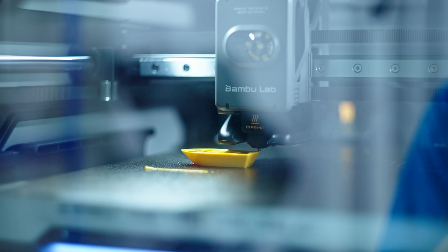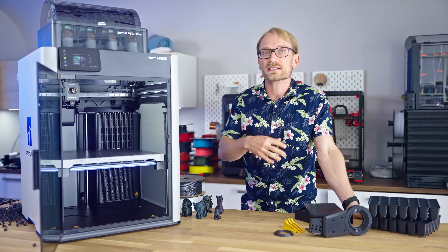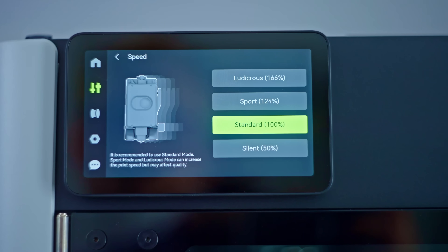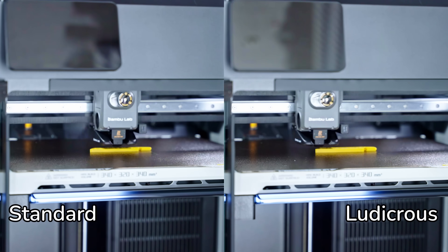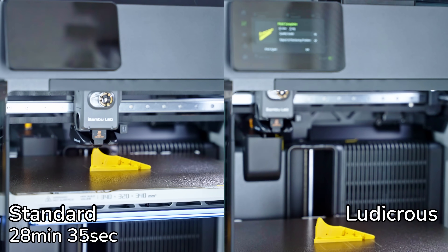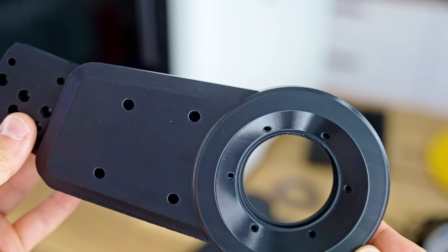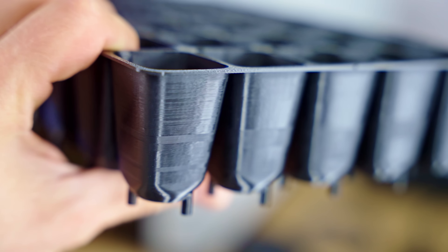When it comes to performance, the H2S might actually have an advantage over the H2D, because even though the motion setup is the same, the H2S only has a single hotend and no lifting mechanism on the toolhead — so naturally, input shaping is gonna have a bit of an easier time compensating for the lower weight of the overall CoreXY platform. With the prints I did using the standard Sport and Ludicrous speed modes, at least with PLA, I saw so little difference in print quality that I had to go back and check the timelapse footage to see if it had actually sped up at all. With plain-colored PETG, I sometimes got some errors where you could tell the hotend was being pushed quite hard, so some areas turned out a little more matte than others.